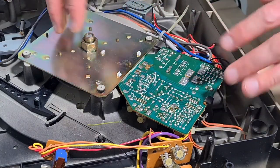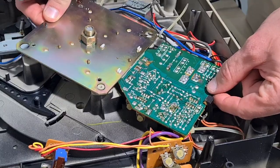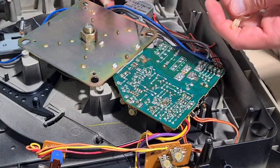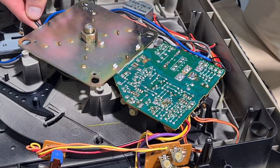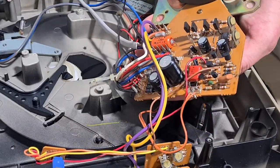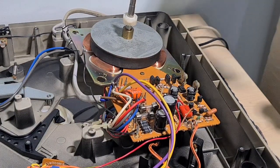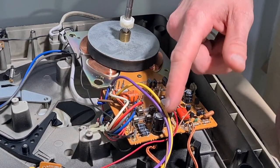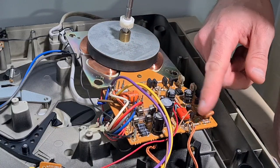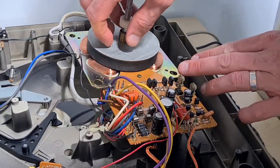We should be able to remove the motor board completely, flip it over, and then clean and grease the spindle. It's heavy and delicate at the same time. There's a little plastic clip down here - cable ties snipped - and there's a little Sony bendy thing they like to hold cables down with. Here we have in all its glory a pretty basic direct drive motor with four caps. The little transistors seem to match the ones that are in that bag, so I'm going to check if these have been resoldered - I might replace them anyway after testing.